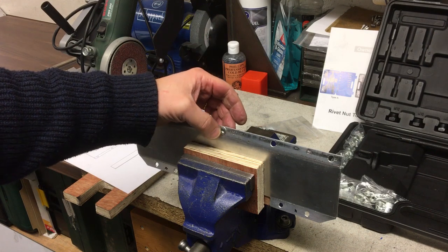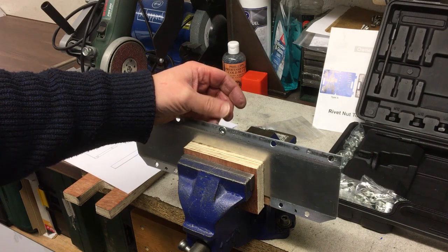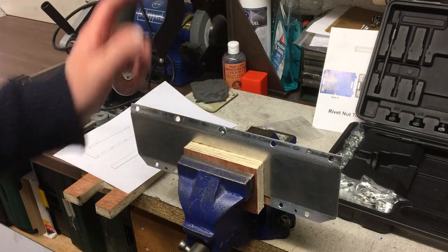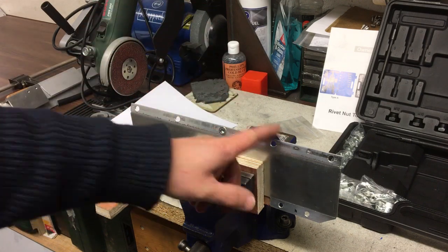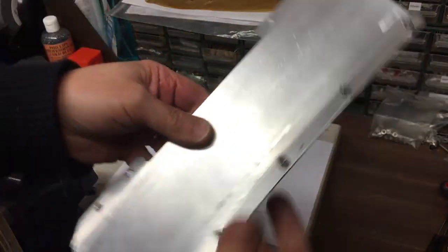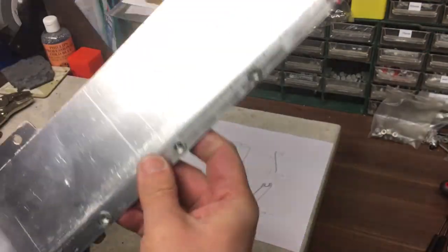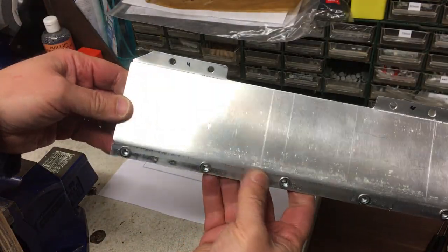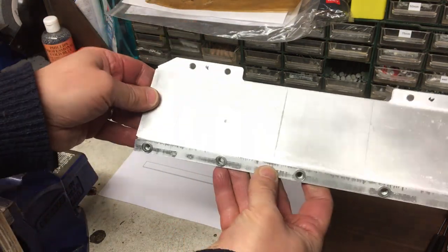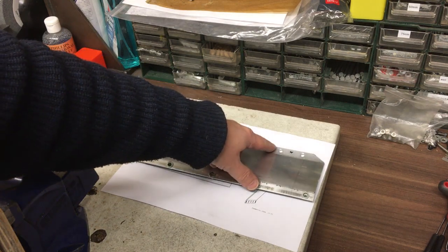Now obviously, with enough torque that will spin and break away, but we're in 2mm aluminium, so hopefully that's got quite a good grip, and it's doing pretty light duty. Right, let's get the other ones done, then we'll bring you back. And there we have the finished piece, so you can see the rivets on the back there. So it'll go on that way round. There you go. Alright, so all we need now is a bit that this bolts to.